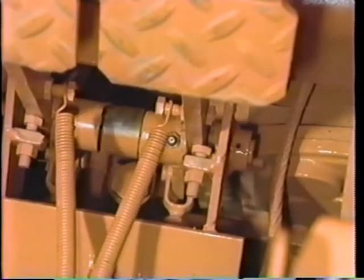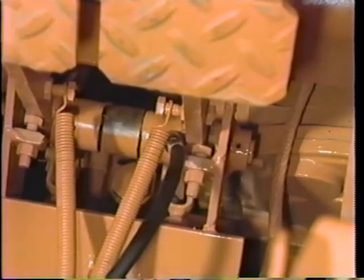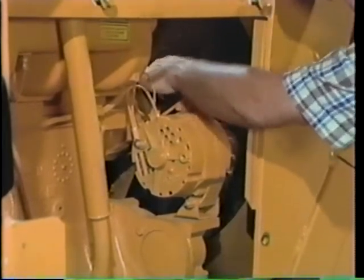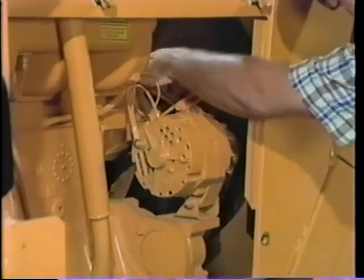After removing the floor plates, you can get at the brake pedal pivots — give each one a shot of grease. If there are enough hours on the machine according to the operator's manual, now is the time to lube the U-joints. Next, check the drive belt tension — total deflection should be a half inch. If substantially more or less, make the proper adjustment as described in the operator's manual.